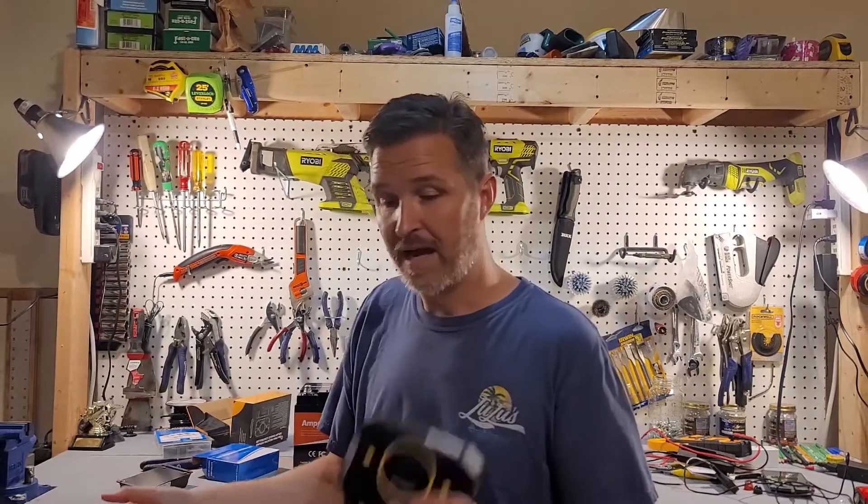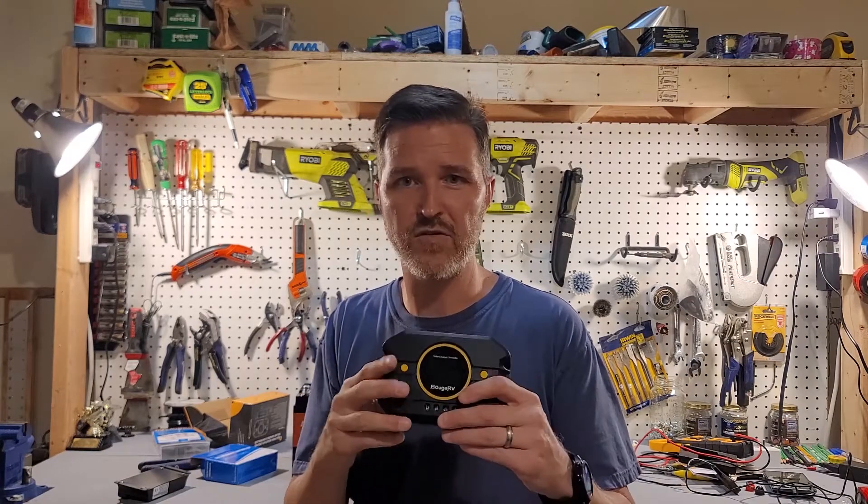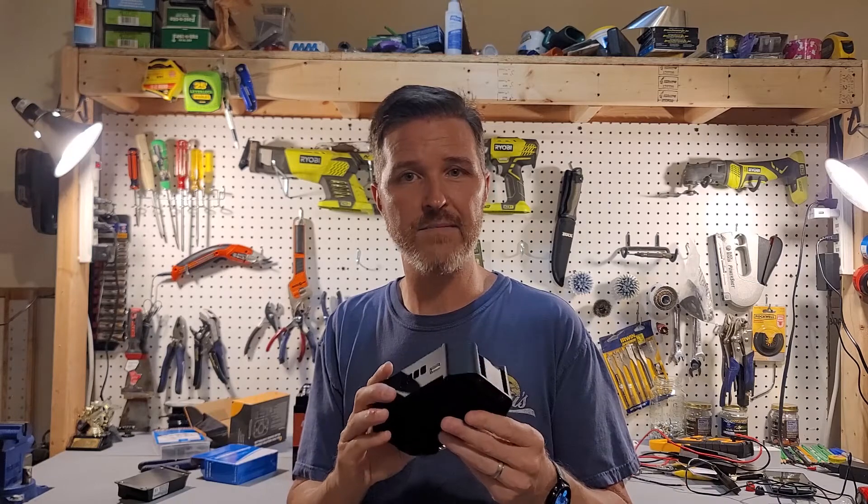So I would say if you're in the market for a nice inexpensive PWM charge controller, don't go with something dirt cheap — you get what you pay for, and a bad controller can destroy your battery. If you're buying a battery over a hundred dollars, or going with lithium iron phosphate at three, four, or five hundred dollars, don't get a fifteen dollar charge controller. Under forty dollars you can get a pretty nice PWM. If you want to go with an MPPT charge controller, you're talking eighty to a hundred fifty dollars. But for 30 amps PWM, this really is your best bet.